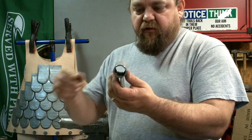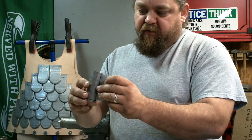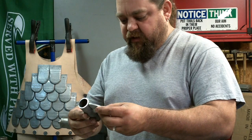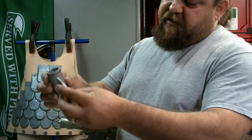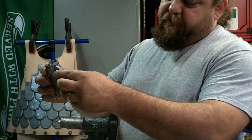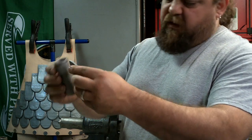With the MIG welder, I can get in between them. It's not going to be that big a deal. Plus, it gives me more surface to hit with. So, probably going to go 6. What I've done here is I've given myself 1/8 of an inch as a mark to have a guideline where I'm going to start setting these so that I can weld them.